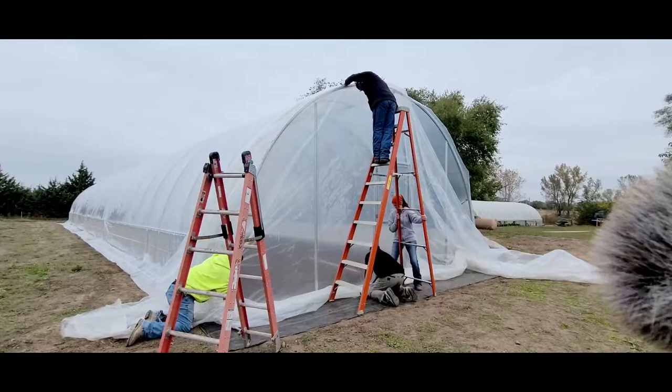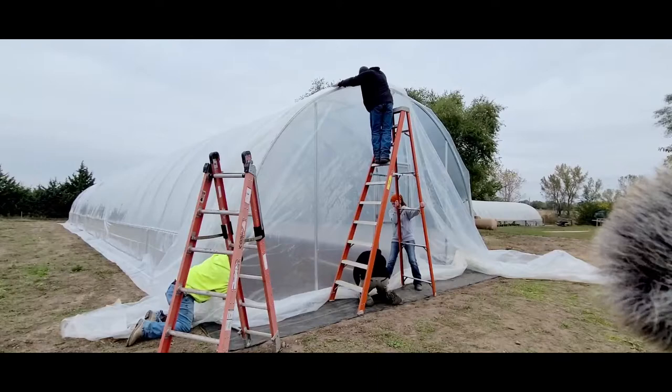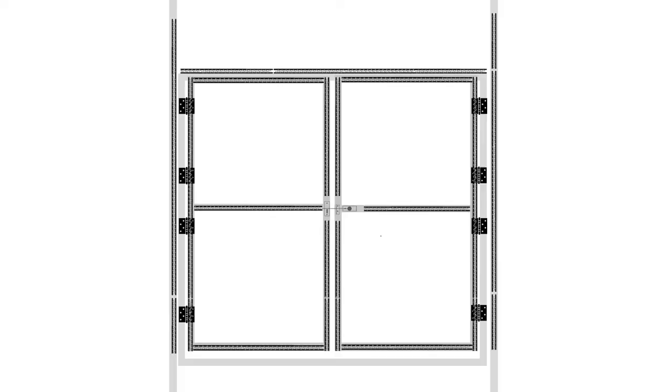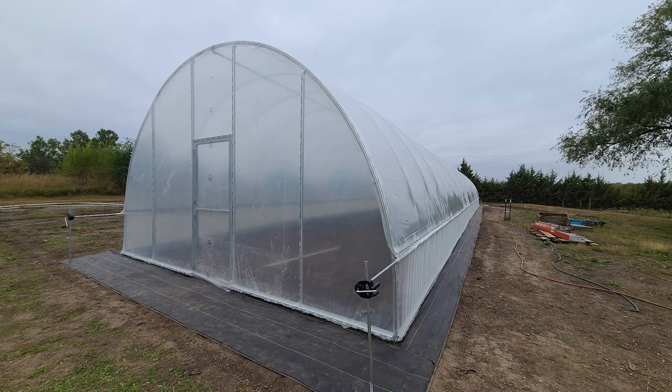You have to pull and push in different directions to get the plastic as tight as possible before putting the wiggle wire in — if you don't, it will bunch and you'll have to redo it. The guy in yellow is tucking away everything and clearing all excess. Once finished, they'll cut out the excess. Before any cutting and especially before opening the door, go around the door frame that has lock channel — around the doors, up the vertical uprights on either side of the door, and on the extra two verticals on either side. Every piece of wiggle wire pulls the end wall tighter. Then simply cut in the middle between double doors or around the door frame, and install the handle.